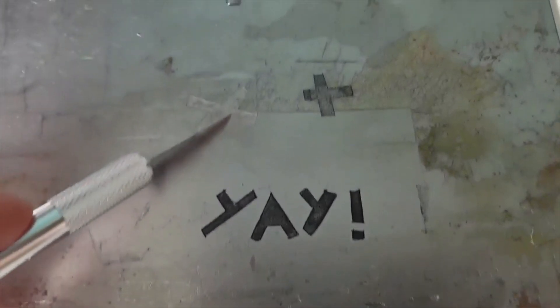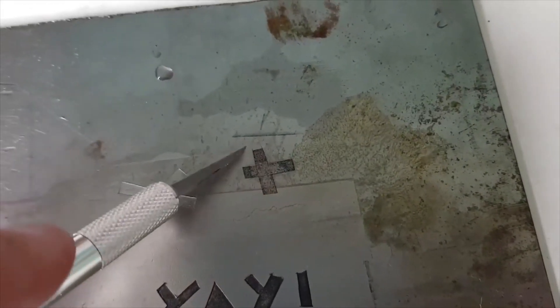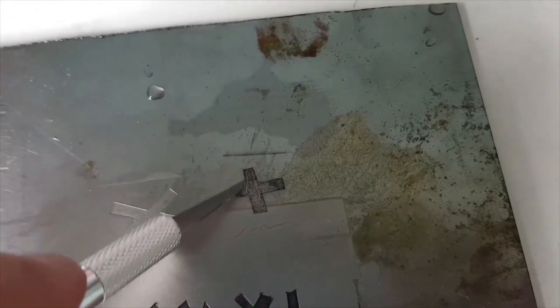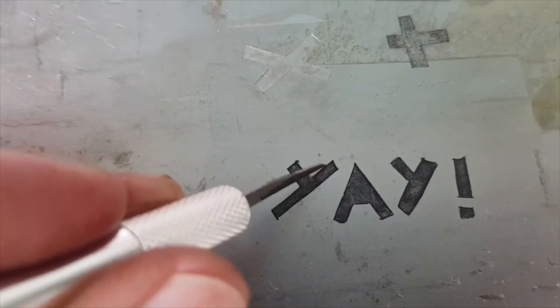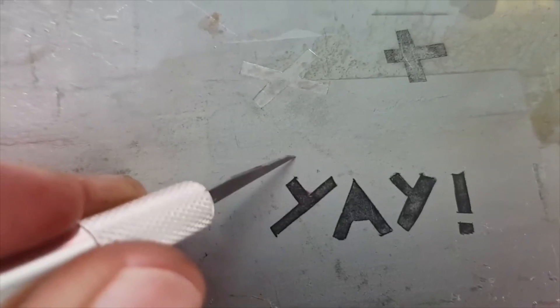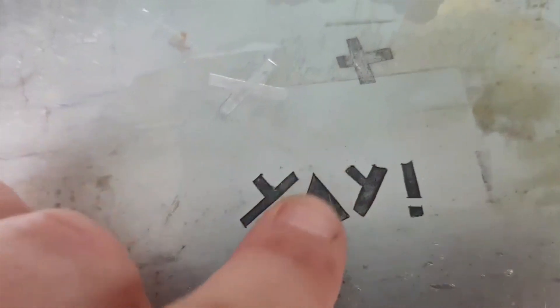Here are the results of the tests. This is with just the etch, which creates a little sort of lip. This is the marking — there's no lip, it's just surface deep, so it could easily scratch off. And here is the result of the two together: you've got the depth of the etch, and if I hold the scalpel right you can see there's a little lip for it to go over, and obviously it's also marked. That doesn't rub off — that stays put. I'm pretty happy with that.